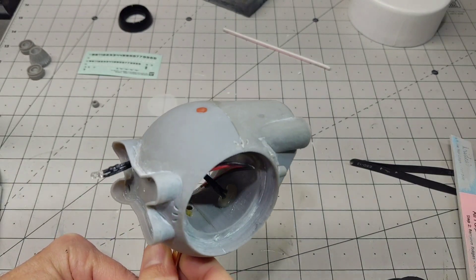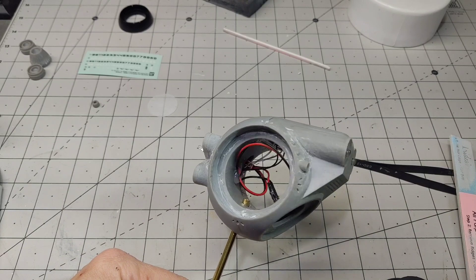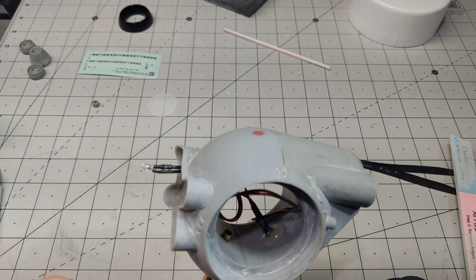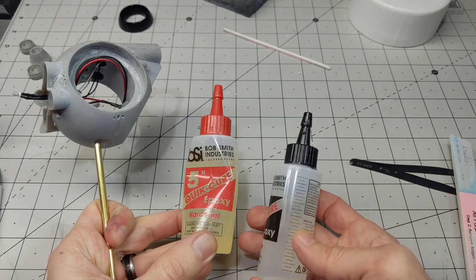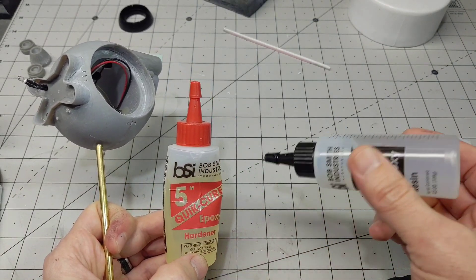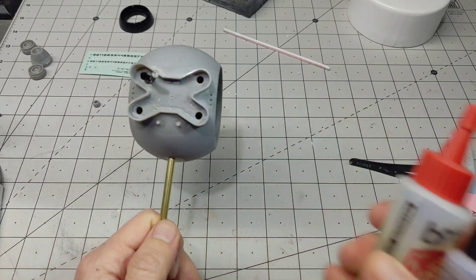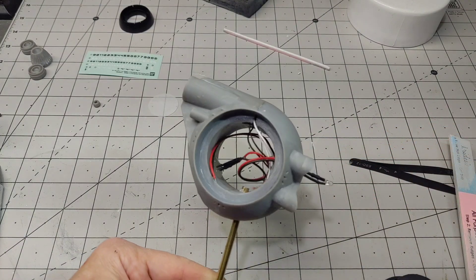After a lot of sanding and different types of putties to fill this gap in, I think I got it pretty smooth - I still feel a little bit of lip there, but I'm going to go ahead and prime over it so I can see exactly what I need to deal with. I need to tape off these lights and put a primer over it. It's all put together as far as the main body. I use this BSI Bob Smith Industries five minute epoxy - you have a lot more control over how much you put on. It works really well and sets up in five minutes. I like to give it a few hours before sanding.